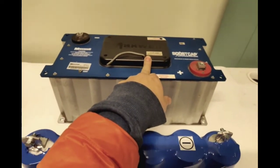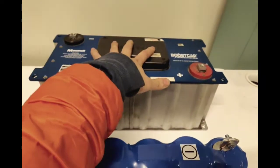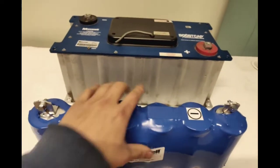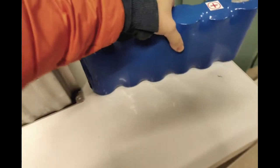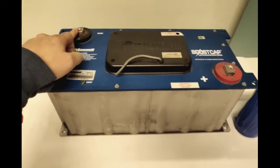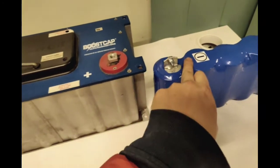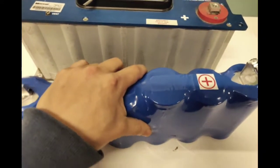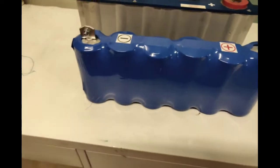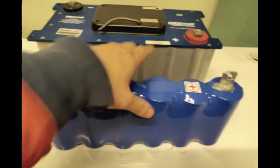For a 48 volt battery system, people are using these in parallel. What you can also do is link a 48 volt bank in series with a 16 volt unit — negative to negative on this side — so you've got negative, positive 48, linked in series to the negative and then the positive of the 16 volt, giving you 48 plus 16 which is 64 volts.